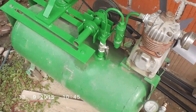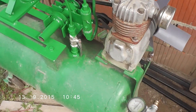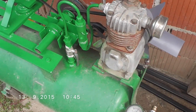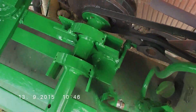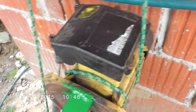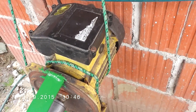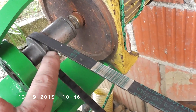Hello, you all remember my homemade air compressor? I was powering this compressor with my diesel engine, but I made some changes. I now use a set of pulleys and a 500-watt electric motor. This pulley here is from a washing machine, and I also use a twin pulley.